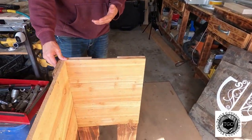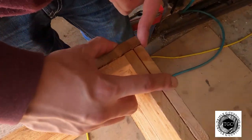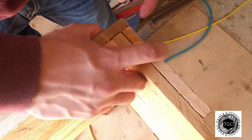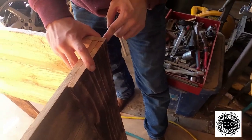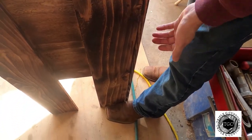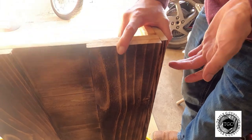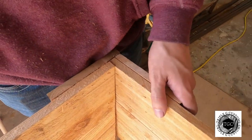This is how we put it together — you can see how it fits pretty much perfectly right here. Put a nail in here, wood glue the whole strip, then put your nail into the top. Line it up on the bottom, get it in, then put nails all the way up. Make sure you've got a good amount of nails and wood glue, and do that all the way around.